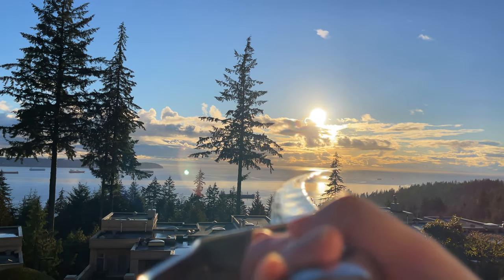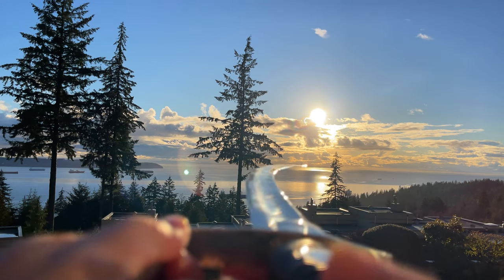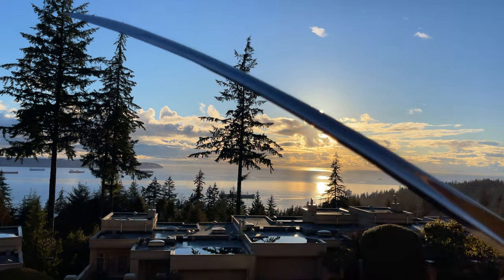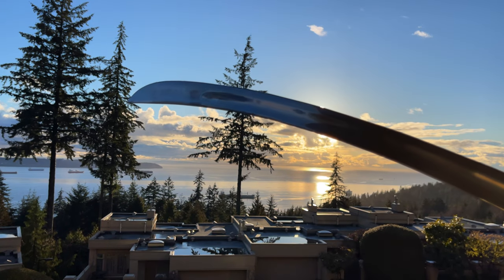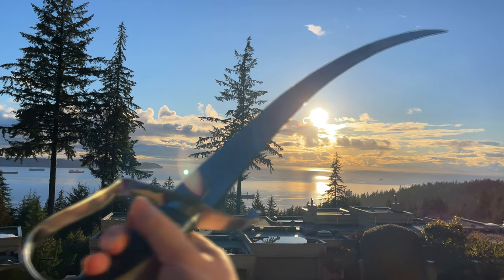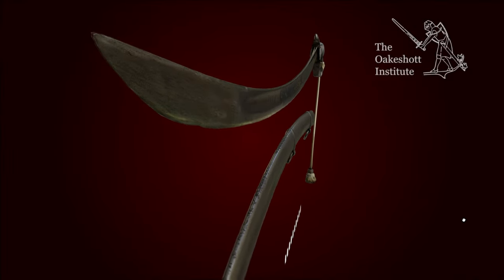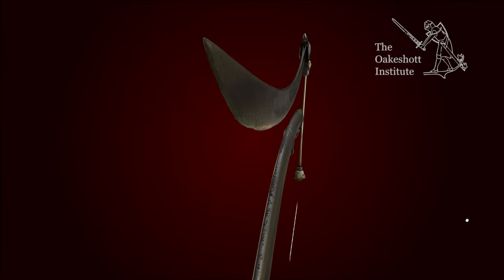In typical Windlass fashion, there's a lot of rippling on the blade surface. This is, by and large, due to the skills, confidence, and experience of the grinder. It has nothing to do with whether or not this is hand-forged. I'd prefer a smoother grind and polish, but since this doesn't affect the functionality, I'll take it. Plus, on the antique originals, many of them have a comparable amount of rippling, especially in the fullers.